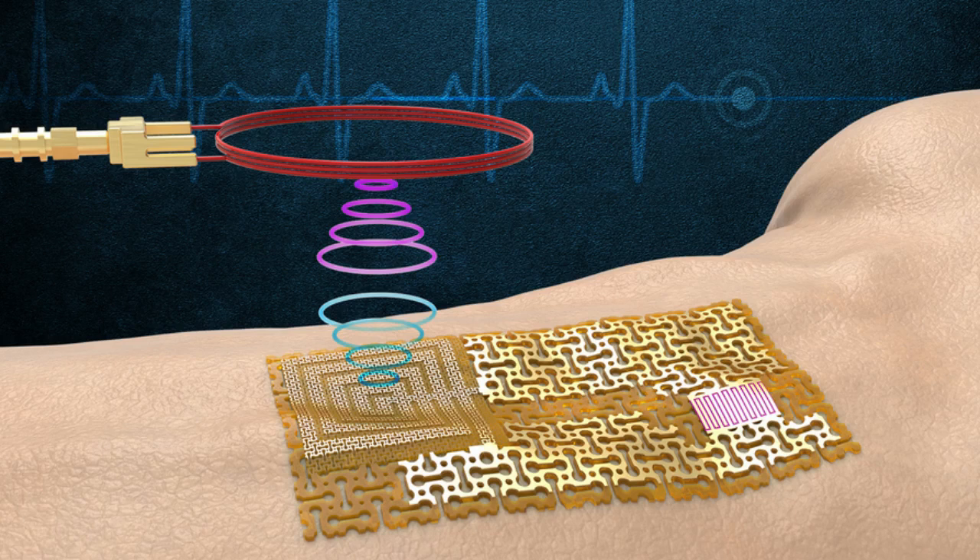The patterns of these waves can indicate a person's heart rate, or even more subtly, the presence of certain compounds on the skin such as salt and sweat. The researchers hypothesized that a gallium nitride-based sensor adhered to the skin would have its own inherent resonant vibration or frequency that the piezoelectric material would simultaneously convert into an electrical signal, which a wireless receiver could register. Any change to the skin's conditions — such as from an accelerated heart rate — would affect the sensor's mechanical vibrations and the electrical signal it automatically transmits to the receiver. Changes in pulse, chemicals in sweat, or even ultraviolet exposure can all change the pattern of surface acoustic waves on the gallium nitride film, and the sensitivity of the film is so high that it can detect these changes.